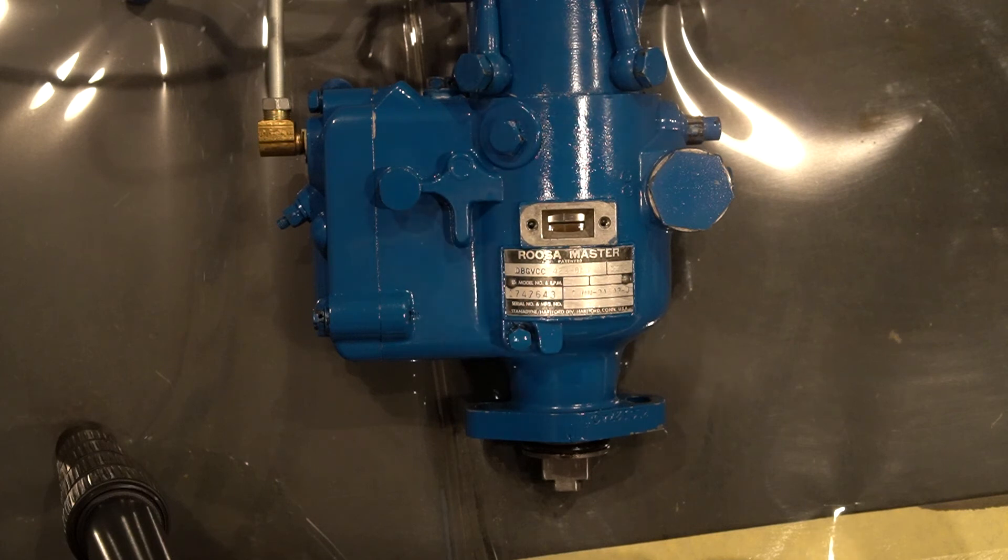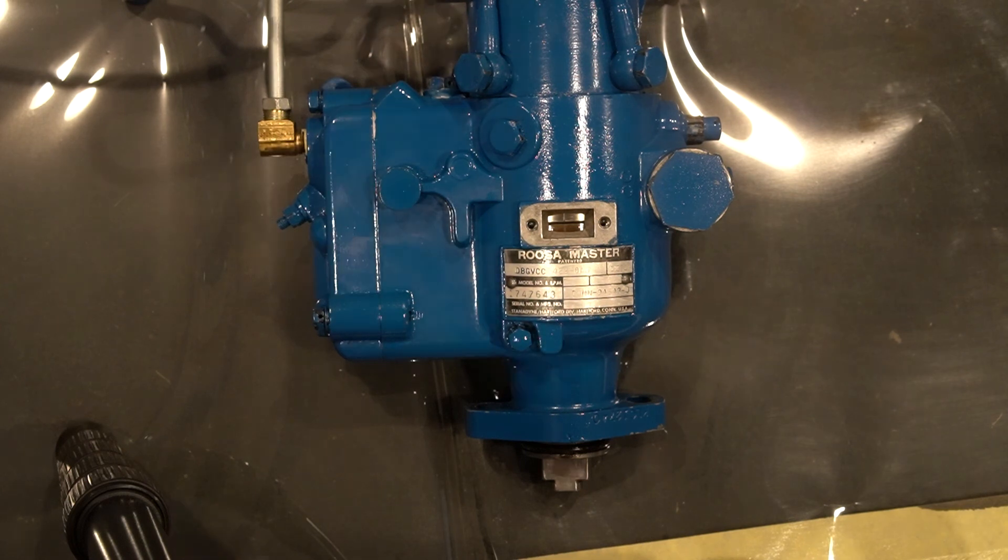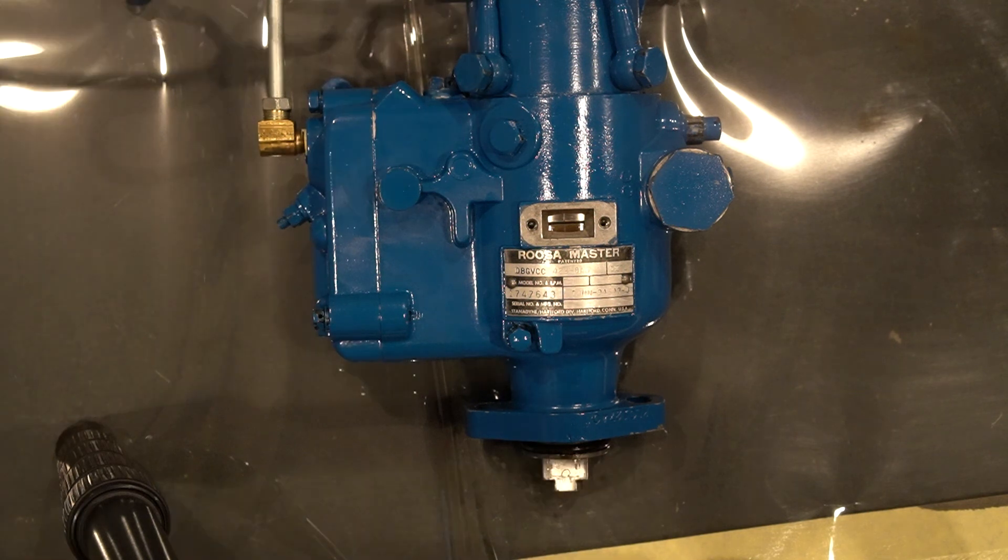The two main things you need to remember when installing your pump are: am I on TDC number 1 compression, and is my pump an 18 or a 23 degree pump? Other than that, mainly the 18 and 23, the steps are identical. And that's pretty much it. Once you get it on, you're going to have to go back and bleed your system. I hope this helps everybody understand how you do this — it's not complicated. If you have any questions, I'll try to answer them. Thanks for watching.